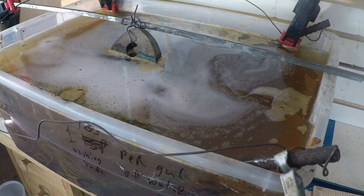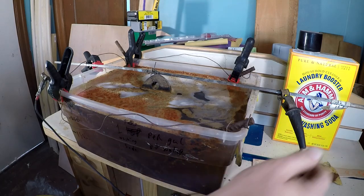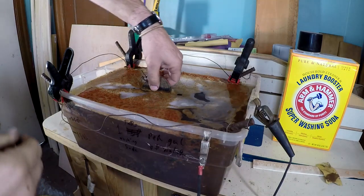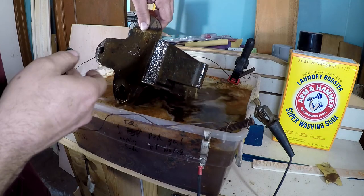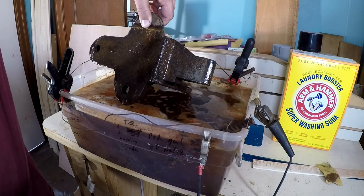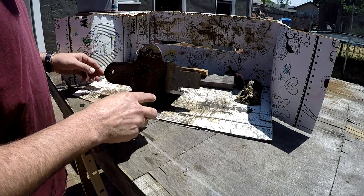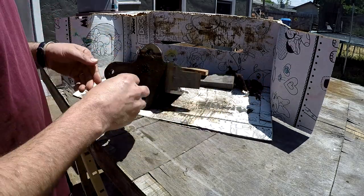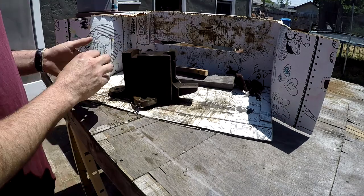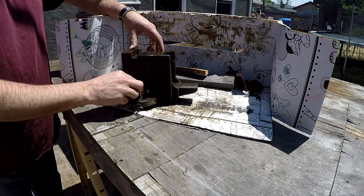We'll pull this out and I'll show you what I do in between. Alright guys, soup's on — let's get this thing out of the swamp water here. Let's go take this out into the light and start cleaning. You can see that stuff is starting to kind of flake off here. I like to try to dry the casting off a little bit first — once it dries, when you brush it, it'll come off really nice and easy. You could brush it right now but it just makes a slurry.